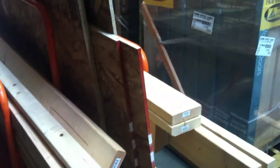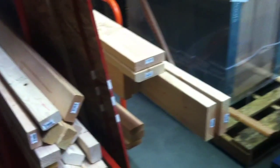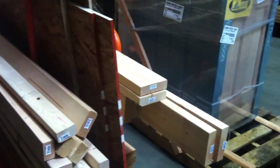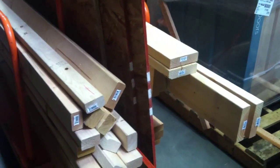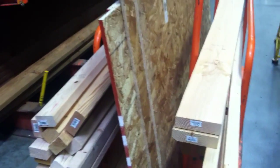I'm going to do this video on several sections, probably its own playlist, on a portable building thing. Once you kind of have a design thought out — and this is one where it's a little bit slow going because it's the first one, it's a prototype — the framing number for the upper framing is two by three on this particular one because I'm trying to save weight. I'm using two by six on a lot of this. The trick in reducing waste and getting higher quality precision cuts is especially important if a lot of the construction is going to be done off-grid, as is the case with this project.